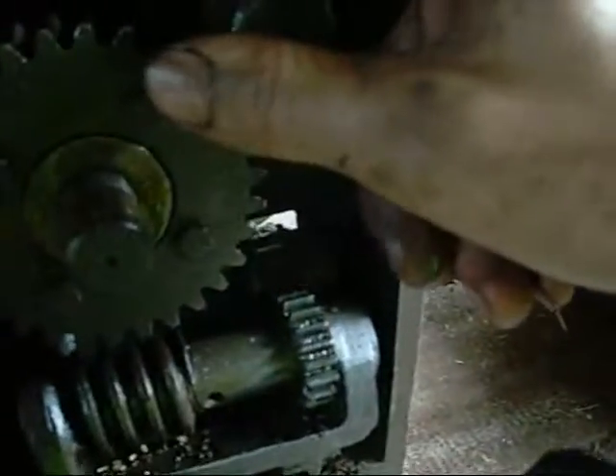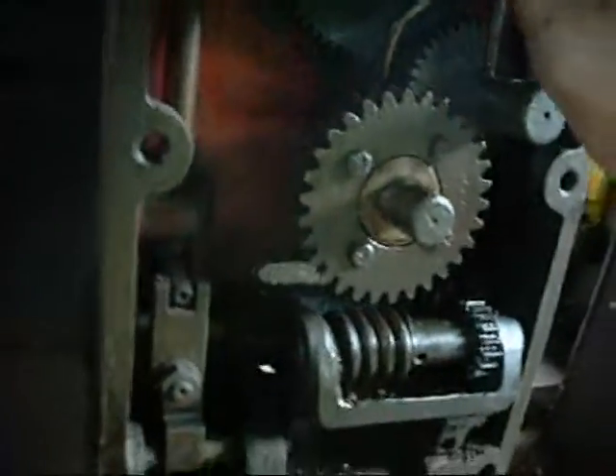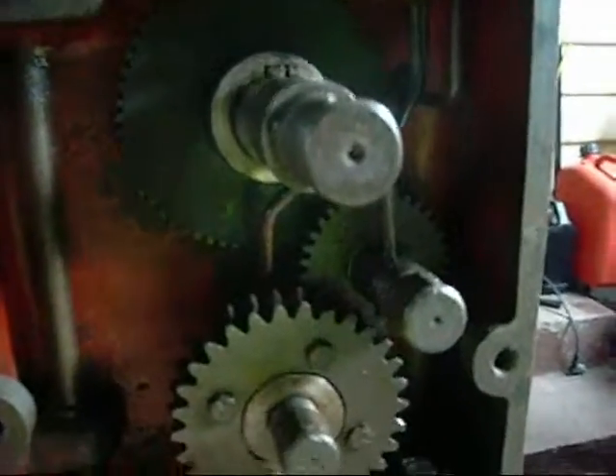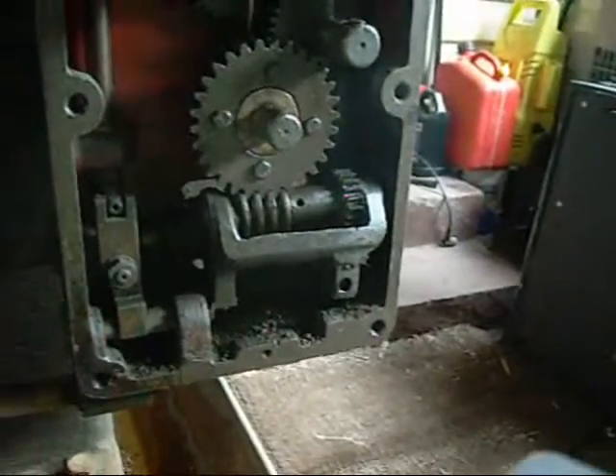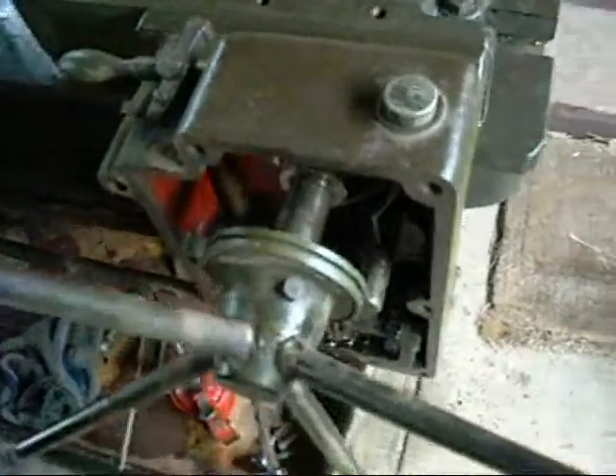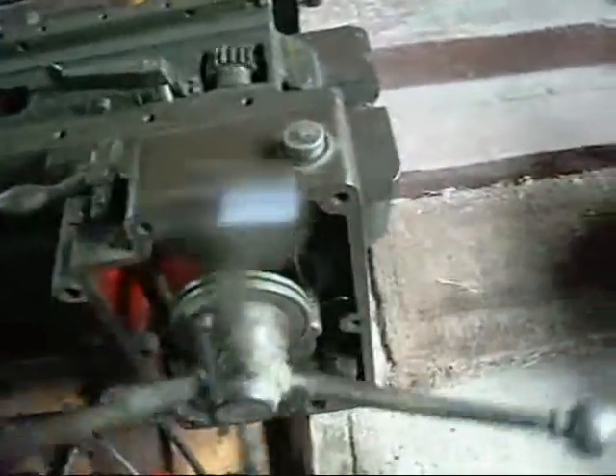This looks fairly free — very free. She's seen a lot of work. I'd say the main bearing in there has been starved of oil too long and it's just sticking, but it does move. That'll do for tonight; I'm going to let this sit and soak. It has freed up a bit but it just keeps binding. It's either that or the shaft's bent — might explain why these have been welded back on. More than likely the shaft's actually bent, stuck in one position.